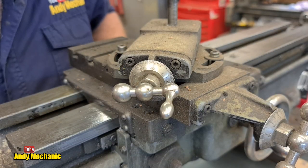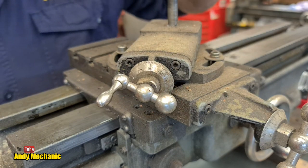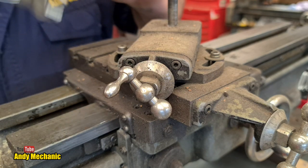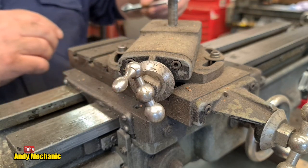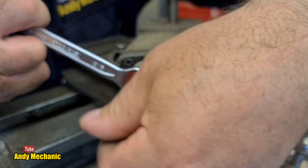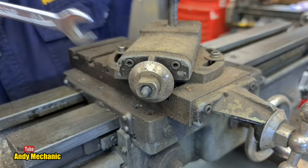Looking at the diagram, it's always helpful - we've got to take the handle off first, and there appears to be a couple of flats on the actual drive shaft itself. Nine sixteenths - oh, that'll work. That should just pop out there now hopefully. Right, another part gone. I reckon probably a five thirty-seconds - oh, that works. I love taking all the stuff apart. I'm actually really looking forward to getting this lathe back together again at some point, hopefully before I actually forget how the whole thing goes - I'll have to re-watch the videos. It sat in the workshop about six months before I even made a start on this project.